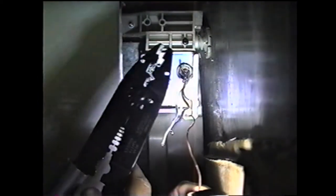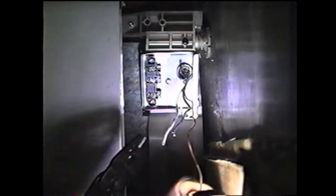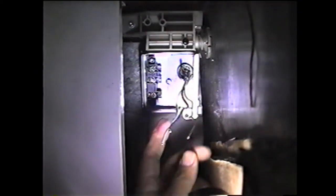The dishwasher is straight up now, so I'm going to have to do the wiring lying down. It would be much easier if it were on its side. The only other option would have been to run a new line to the basement, which is more work than I want right now. Before making the connections, I'm going to cut the ground wire, which is kind of long, and try to make it the same size as the other wires. I'll cut it right there.